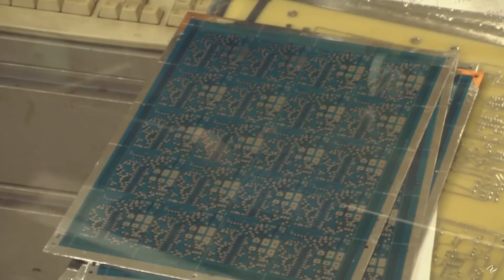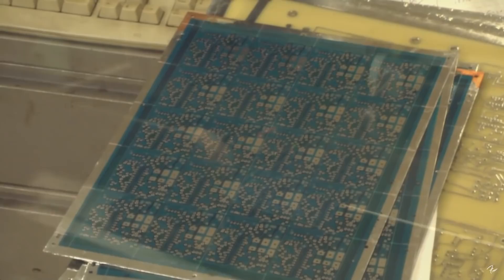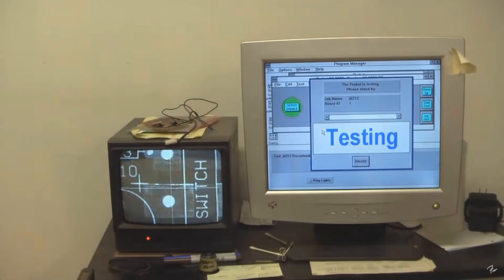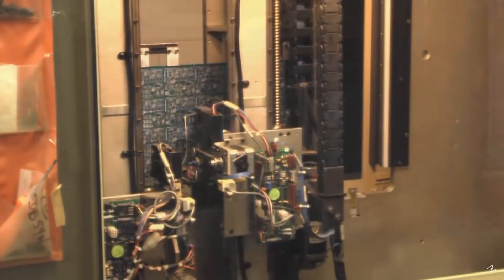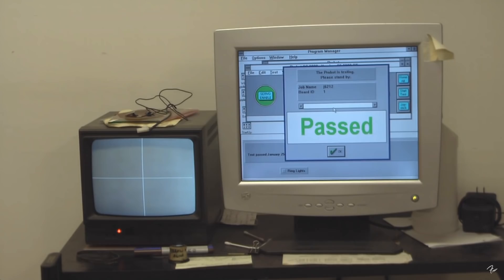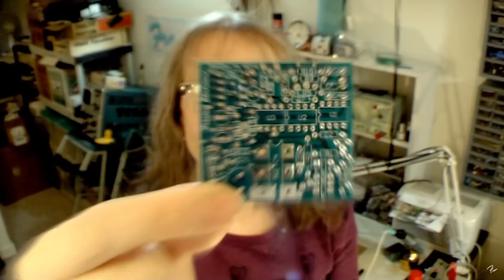Working board — we'll have a finished, clean panel of boards that we can actually use when we do the final assembly. The occasional piece of dirt that gets on the board in the optical process can cause a little piece of copper to remain and cause a short, or you can have an open. Congratulations, it's a pass! And here it is — the FranTone Brooklyn printed circuit board. So much time went into this — it really is like one of the greatest expenses of manufacturing.